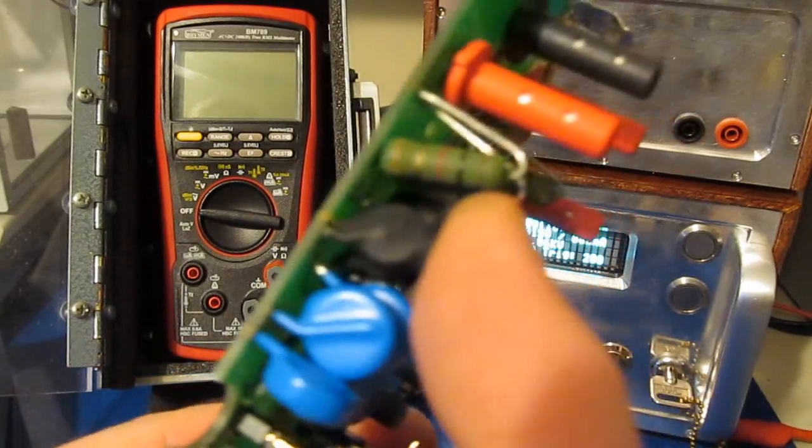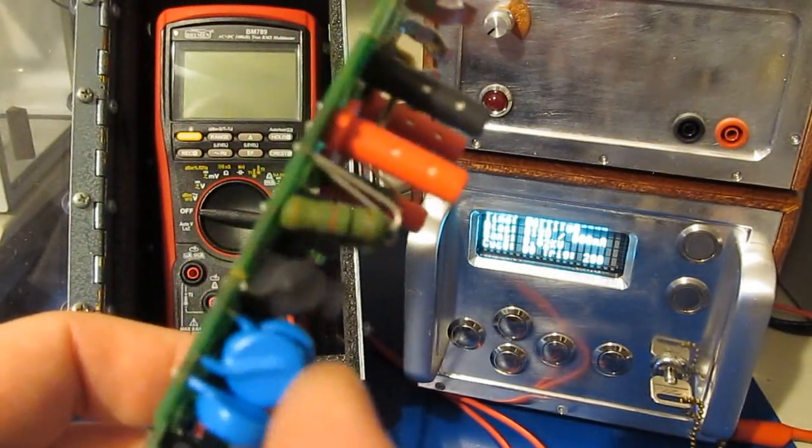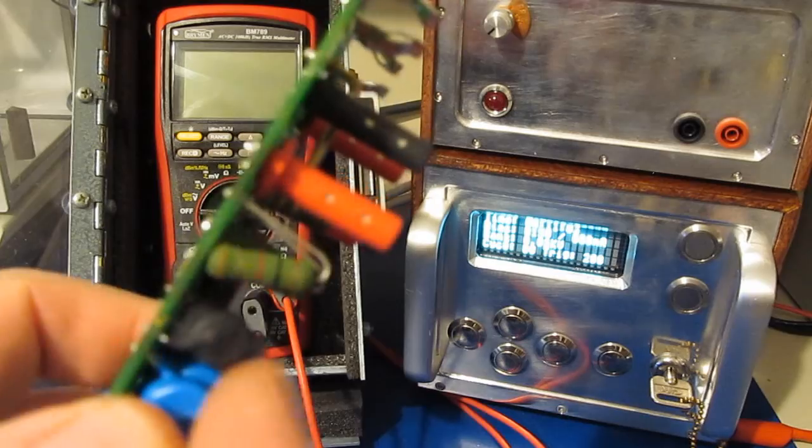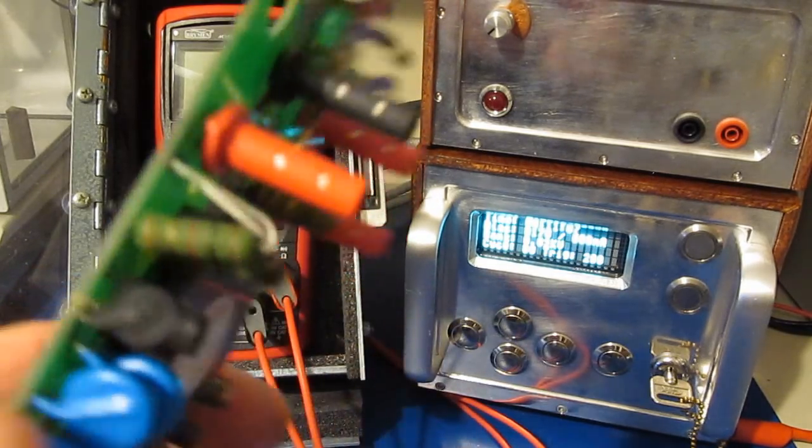Normally the PTC isn't going to respond fast enough to a transient like this just because of the thermal mass. So what ends up happening is we subtract off the voltage of the two MOVs, and then the rest is divided by the two resistors, the PTC and the surge rated resistor.